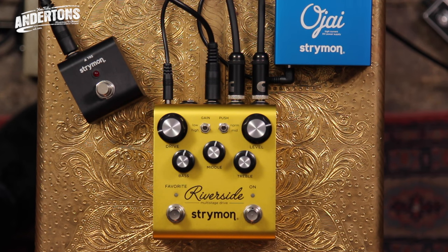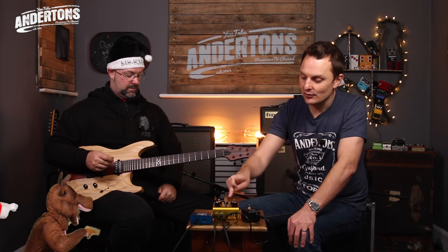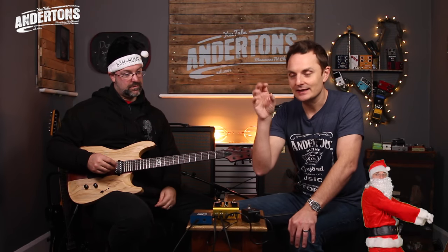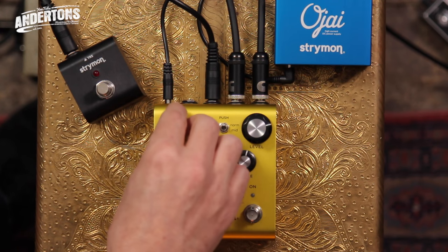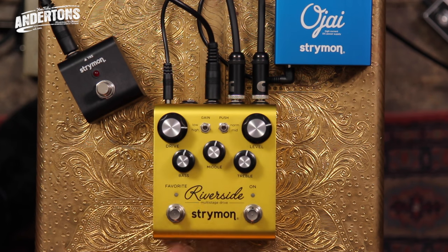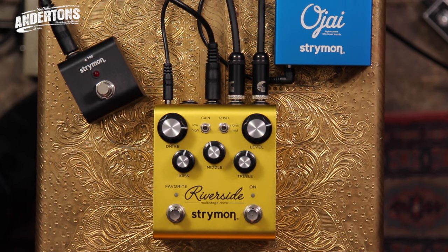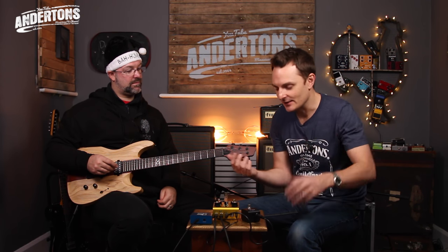What's clever though, is the DSP controls the way that the EQ is voiced depending on how you've set the analog gain stage. So as you begin to drive the input gain more, it will change how the mid-range control reacts and the frequencies it's adjusting, to best interpret what it thinks is the nicest gain sound.